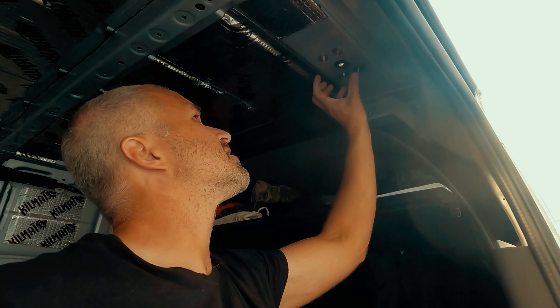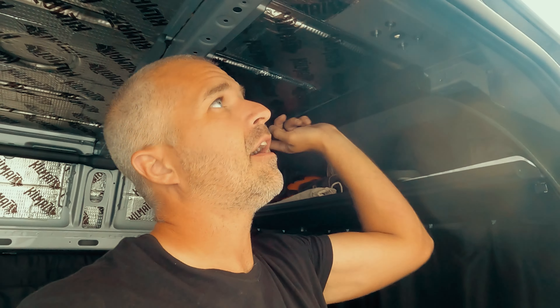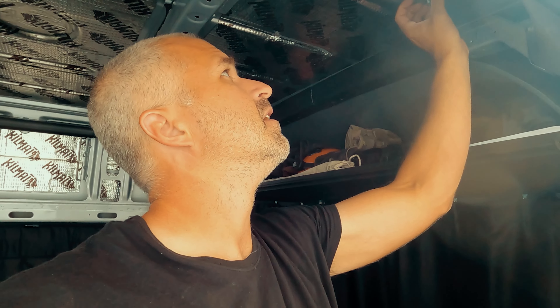Okay, so we got it in. It's bolted nice and tight. Paint's dry. Grommet's in. Butyl tape squished out really nice. So I'm just going to feed the wires up through into the box and then out to where they're going to go. Tighten those caps, close in the top, make it all watertight, and then we'll come back tomorrow and finish wiring everything up.